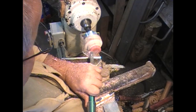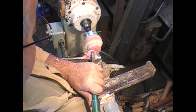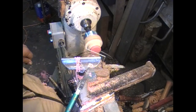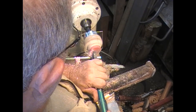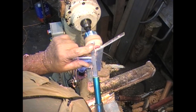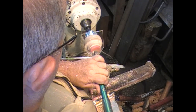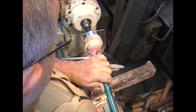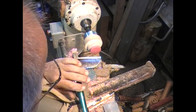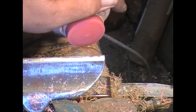Don't forget when using these big thick tools with that riser — that rise — you need to adjust the height of your tool rest. You don't want to be cutting so high above center that you get a catch. The R2 cuts only in the center, not off the edges. That's pretty nice, huh? That's ready.